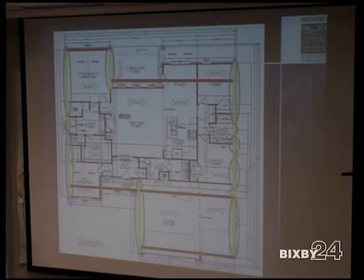Just don't count the brace wall. You gotta count that though. You have to count this as a braced wall line because it's an outside exterior wall. Every exterior wall has to be part of a braced wall line. You can't just ignore it. Yeah, I see what you're saying.